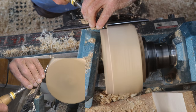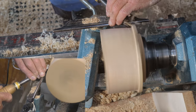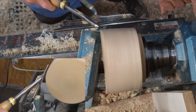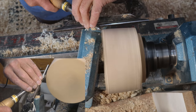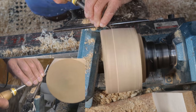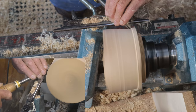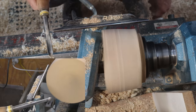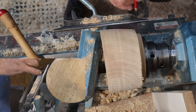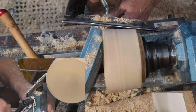So that's a shear cut from there. I've got the bevel lined up with where I want to go, which is straight in. Once I'm in there, this is a 3/8 half inch spindle gouge. It's there now. The bottom, I can still go another, I'll probably take off nearly half an inch off the diameter, and I can come up from the other end for that.